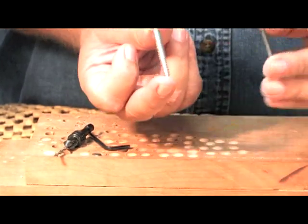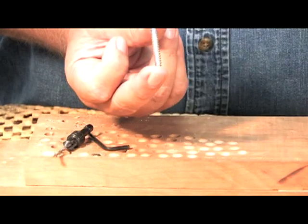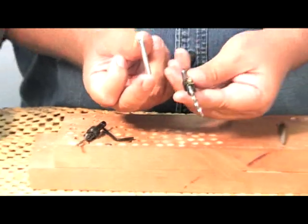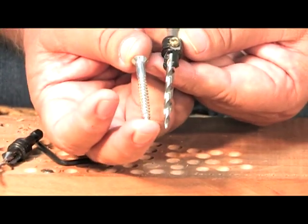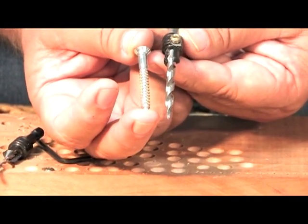The silver screw is more of a tapered design, and it represents the way wood screws have been made for years and years. If you prefer to use that style of screw, then you need to drill a tapered hole. Snappy can help you take care of that — the exact same quality countersink, this time simply mounted into a tapered bit to go right along with it.